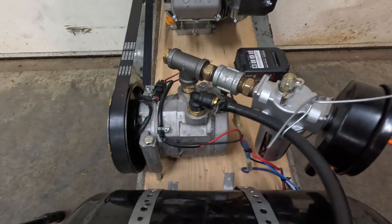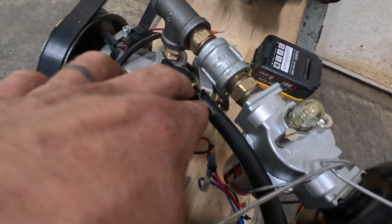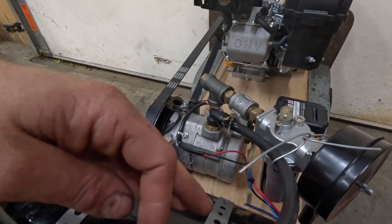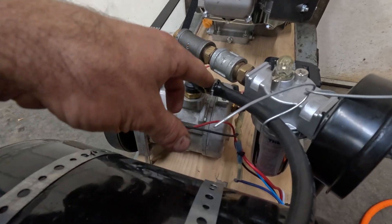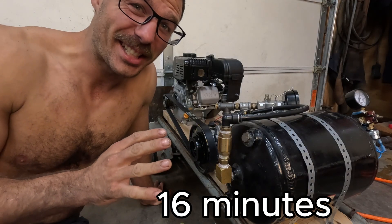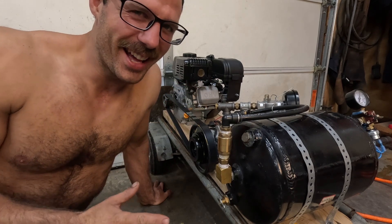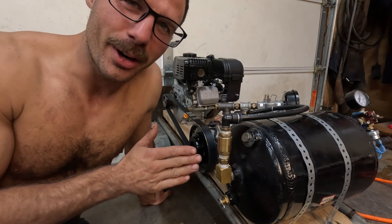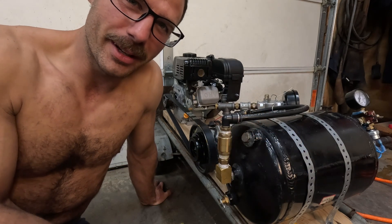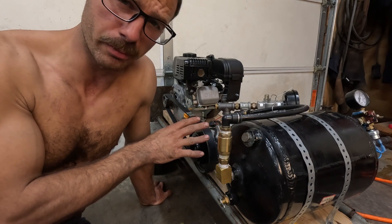Just as I was turning it off, the air line for the discharge blew. You probably shouldn't use nylon air lines for the discharge because even on a normal setup these lines tend to get pretty hot. We just made our pressure and it blew. That took a whopping 16 minutes to fill that 60-gallon air tank. To be fair, compared to our baseline of 3 minutes, we did fill the whole shop air system as well as our tank on our unit — so we could probably deduct a couple of minutes — but I still can't say I would recommend the AC compressor as your main shop compressor.